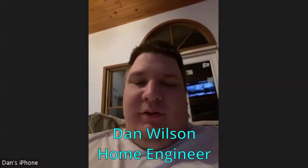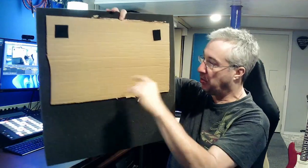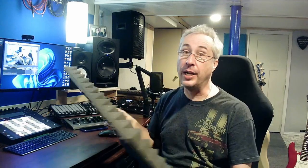My room is 15 by 17, and I'm centered on one of the 15-foot walls. We've got three common types of absorption. First is foam — we have a video on that. This is two-inch pyramid foam. This is great for renters: glue it onto a cardboard backing a little smaller than the panel, use a couple of double-sided velcro strips, and you just stick it on the wall. When you're done, peel it off — maybe have to touch up the paint — but no nails, no screws. And this stuff actually works.